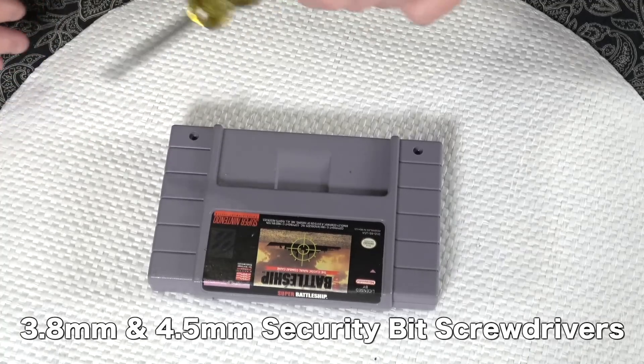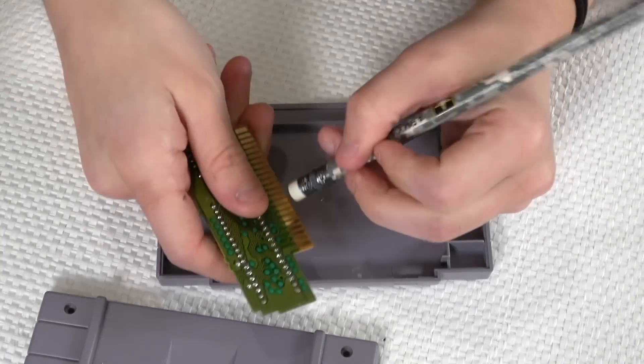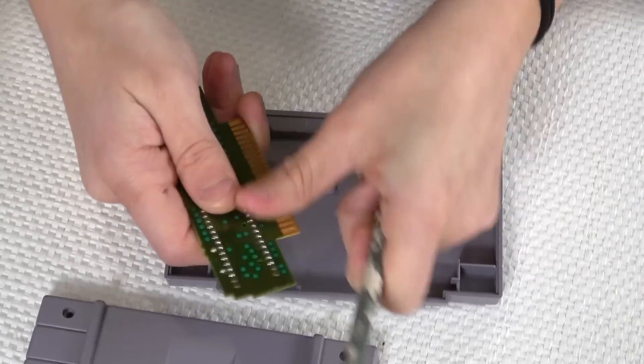I also like to open cartridges up if they have any more issues. You can get at the board itself and look for any dings or breaks in the metal where metal's supposed to be touching metal but isn't anymore, and then do more general cleaning. If your game still isn't working, there are other ways — it doesn't mean it's gone forever, but they start to get more complicated and involve things like heat guns and soldering. Often times the batteries are dry on cartridges. It's not particularly difficult, but you do have to have a soldering iron. There are tons of game stores and local people, even on Craigslist, who are able to perform those sorts of services. John Riggs also has a channel where he resurrects cartridges from the dead.